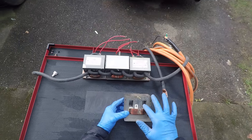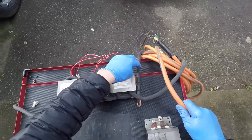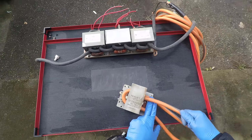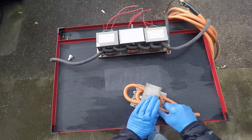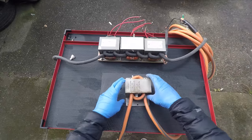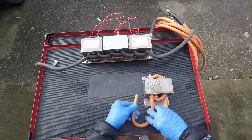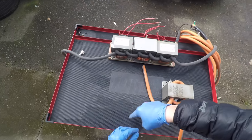Let's go ahead and make our new secondary coil winding. I'll use this cord which is about the same width as the original. To make our winding, we just pass the cable through and out the other end, and we're going to do that one more time. You want the cable entering and exiting the transformer on the same side — so right here we just have a coil with our in and out. When you have your second and third transformer sitting next to the first one, you do the same thing: feed the cable in and out, in, out, and same thing into the next.